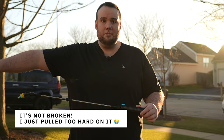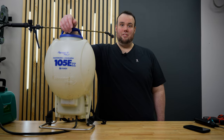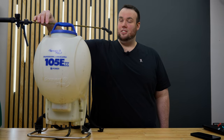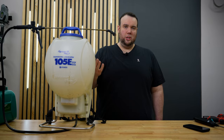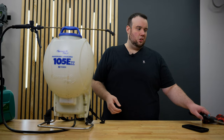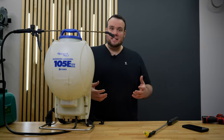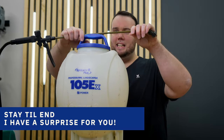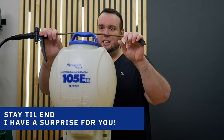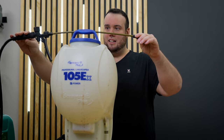So when you make your applications, you could have the wand out farther from you. And even my $220 sprayer that I have right here doesn't have a stainless steel wand. As a matter of fact, the wand on this one is made of brass, and it's a lot more brittle and bendable than the stainless steel wand that comes on this cheap sprayer, believe it or not. I find myself bending the wand on this sprayer pretty often — even doing mundane things such as attaching it over here to the cap, because it uses friction and it just doesn't give me a lot of confidence.